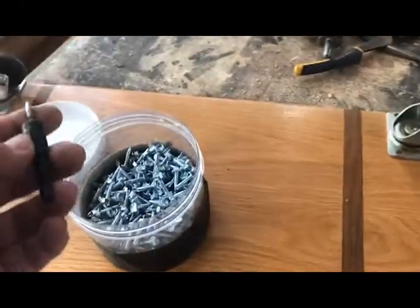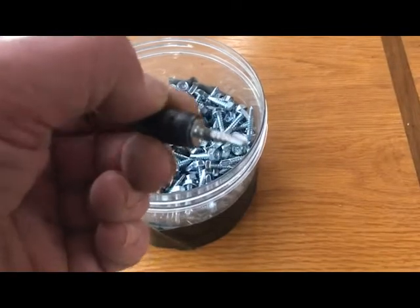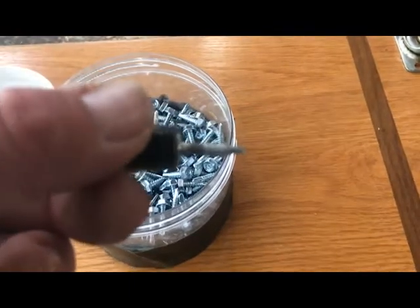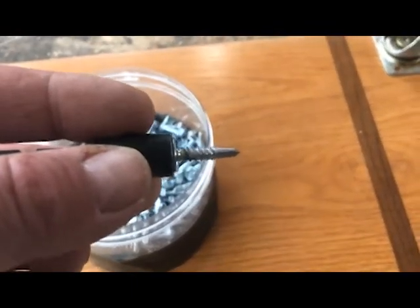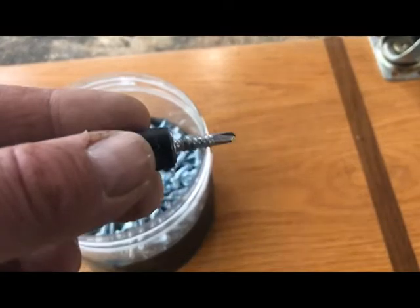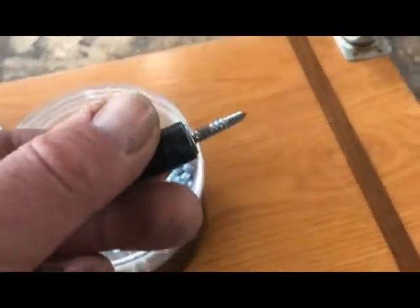The way I'm going to attach these wheels is with little sheet metal screws, which are kind of nice — they have their own little drill bit on them, self-tapping. They've got just a little bit of thread on them, but it's going to be enough to hold these wheels on. There's not going to be any pressure trying to pull the wheels off; it's all going to be downward force. These screws are pretty much just going to be pegs holding the wheels to the wood, and I think that'll work out just fine.